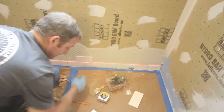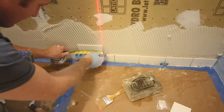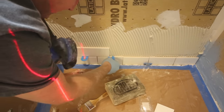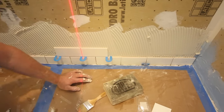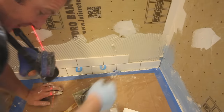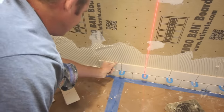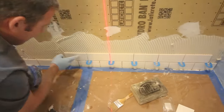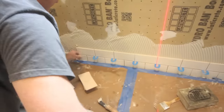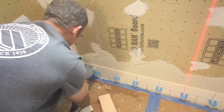We're centering this tile over top of our first course, making sure it's absolutely centered using our measuring tape and our laser level. We're adding 1/16th horseshoe shims between every tile so that we have a consistent grout joint. You can also add those shims on the vertical grout joints, but we didn't in this particular case. We're feeling for any lippage as we go — that's really important because you don't want lippage for these little tiles, and it didn't really make sense to use a leveling system.